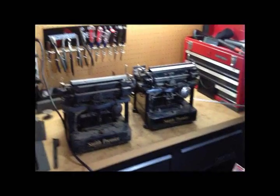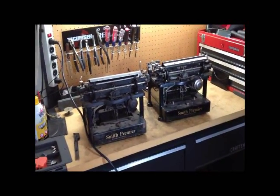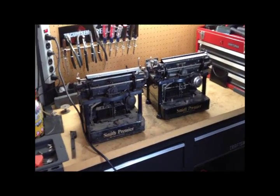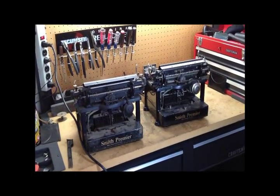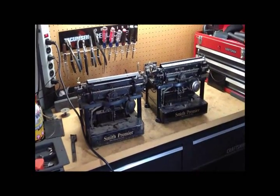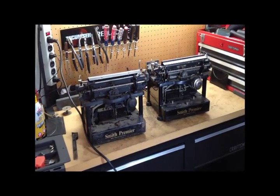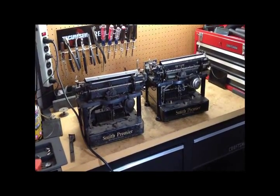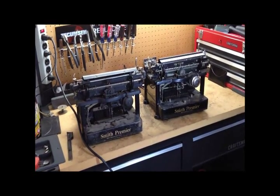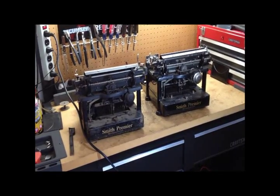The whole wrap on this video: you never really can tell when you look at patents and designs and read all the principles about converting a typewriter — you have to get the machines in front of you. This is a pretty straightforward conversion — changing to what was sometimes called the knife-edge or knife-blade type bar for modernity and to enforce alignment. There are plenty of good reasons to get rid of individual bearings. This is not the type of change you'd have seen had Fox been successful converting their machine to a slotted segment — that machine had two type bar mountings at two different lengths. Good luck converting that, which is why they came out with a portable and then failed. There will be a test — I don't know when, I don't know how I'm going to grade it, but there you go.